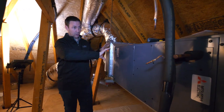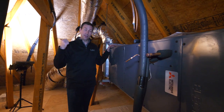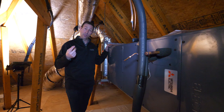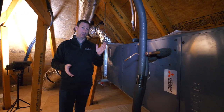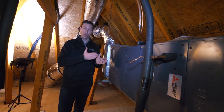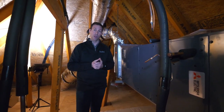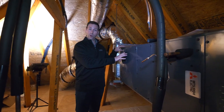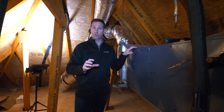This system — this big gray box — looks like a standard upflow and will have standard grills and registers in the house. But outside is that VRF compressor, which means instead of a standard system that has one speed or two speeds — either off or all on, or running at two-thirds speed and 100% — the unit outside that feeds this machine is variable. It can go from 15% of capacity all the way up to 100% and modulate anywhere in between. On a day that's not super hot, it can run at 40–50%, and as it gets hotter through the day, it can ramp up the compressor and give you more capacity.